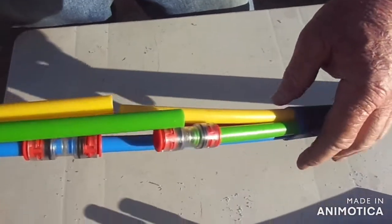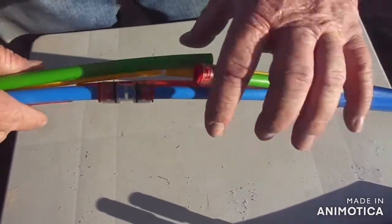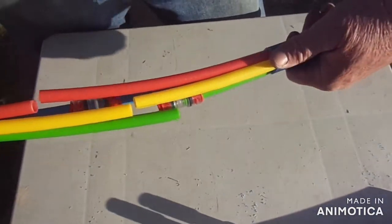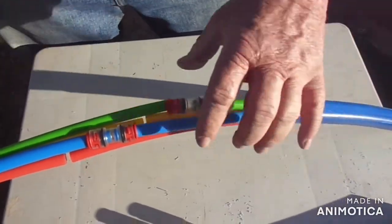To complete the rest of the joint, you need to stagger your couplers — they're not supposed to all be in one bundle, otherwise it's going to be a thick bundle. So you do what they call staggering. As you can see, I've cut all the pipes in different lengths, so your pipes will be installed at different positions in the manhole to avoid a thick joint.